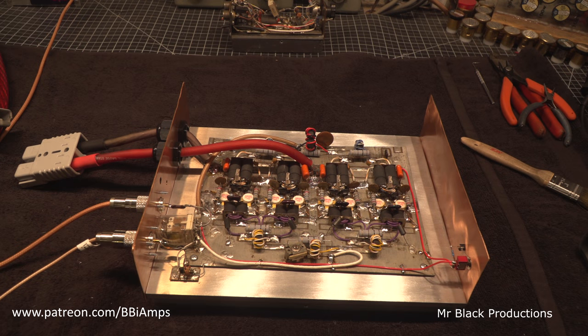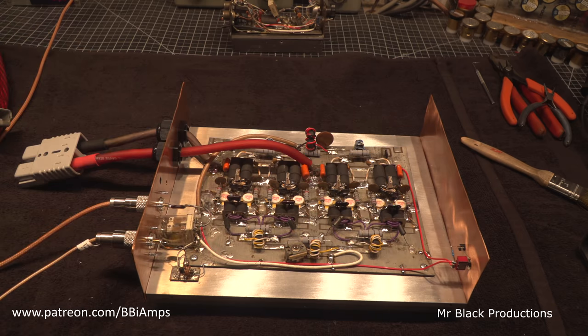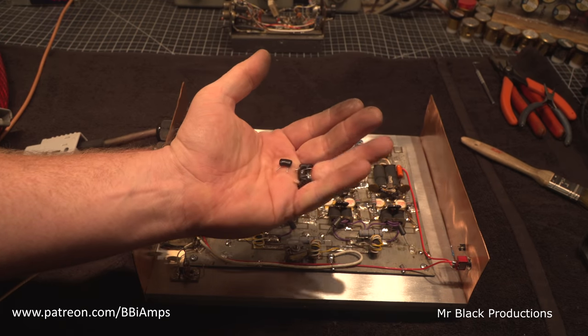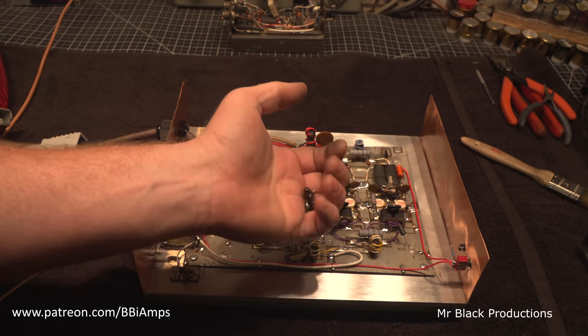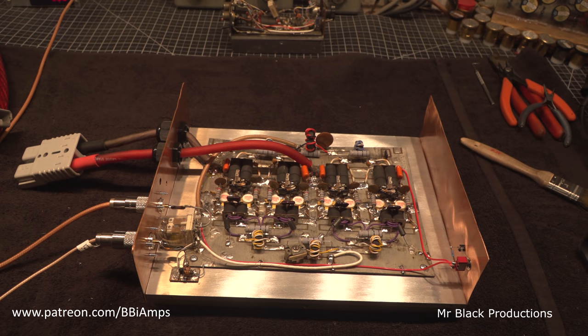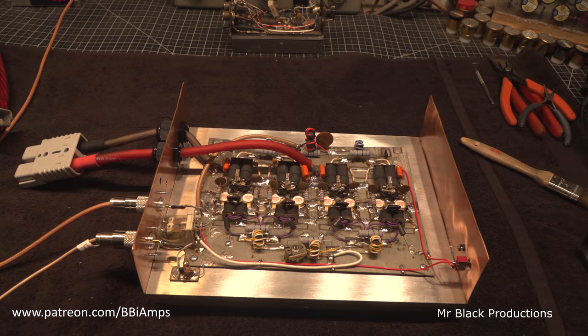This thing turned out really quite nice. I washed the board, ended up having a blown pill over here, and what ended up being the problem — which is really a common thing — are these output capacitors. These are all supposed to be about 720 picofarads. None of them read over 650, and one was all the way down at 480. I went ahead and replaced the output tuning capacitors on the output transformers with metal clads of 725 picofarads — off by 5 puffs, but they're metal, so they'll never break down again.